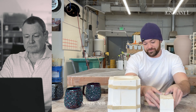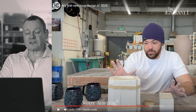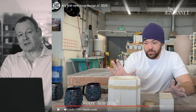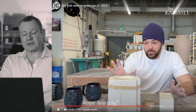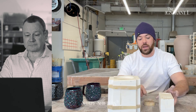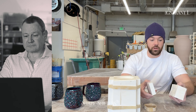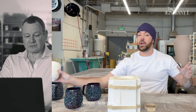If you think about this — if he has a mold and one of those handmade mugs is maybe 40 or 50 dollars, it's in his best interest to have 20 molds so he can pour 20 mugs at one time. When you pour liquid slip into a plaster mold it has to set for maybe an hour, occupying the mold for about an hour. You could do maybe six slips a day if you're handy with some help. The more molds, the more money — this is why mold making matters. The mug in total is eight mold parts, with really efficient ways to cast and clean them up. The seams from the resin printers and polyurethane mother molds are fitting really tightly.